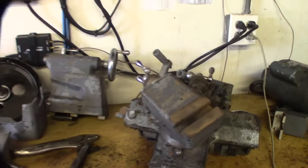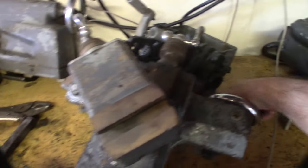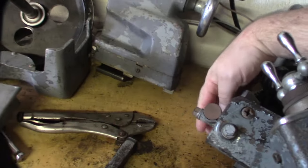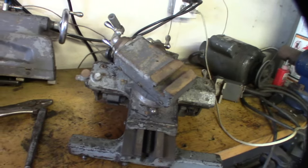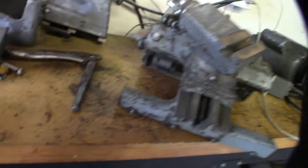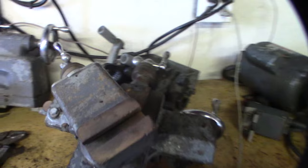This is all the components I still have to work on, but whatever this guy was using, the oil was super gummy, so it was really hard to turn — everything was just super gummed up, nothing turns freely. I'm going to start taking the compound off, cross slide, take the apron apart. The cool thing is it did come with extra half nuts, but those look pretty good. The lead screw — the main lead screw — looks perfect.